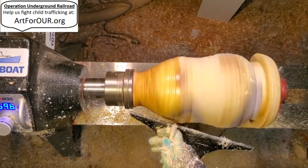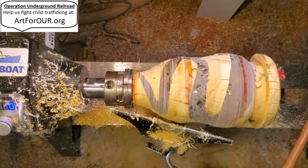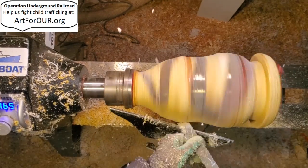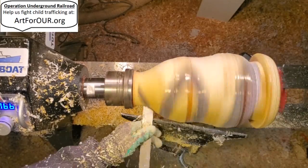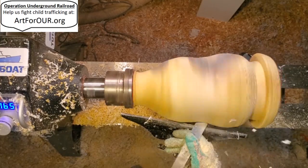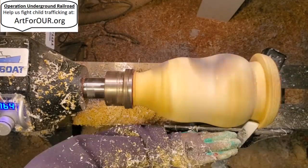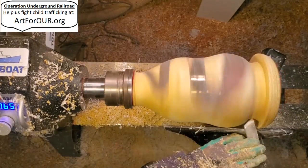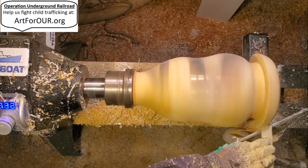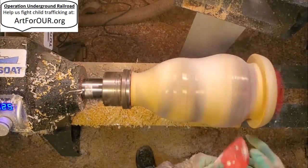One other big issue I had is this river formation. You'll notice it kind of cuts back on itself pretty steeply in a couple places. Some air got stuck underneath those ledges, and that created some big bubbles too. I don't know how I would avoid that. This 3D surface, you know, you can't... I envy the guys doing these river tables because it's just flat and easy to handle, but when it's 3D, it doesn't matter what direction you point it, you gotta submerge the whole thing. Turns out those bubbles weren't as big of a deal, but yeah, that's the battle with resin.